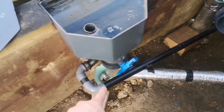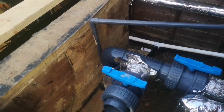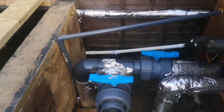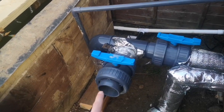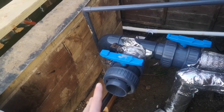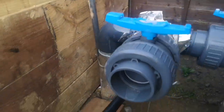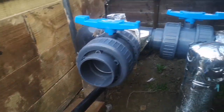There's a three-inch line from the skimmer that goes into the drum filter. That's the waste pipe which also joins up with the drum's waste and goes down to the front. This pipe here is the air pipe for my bottom drain, and then there's the four-inch line for the bottom drain — I've got a purge valve on there which works really well. One thing I'd have done differently is put the purge valve lower, as the lower it is below the water level the more pressure you get through it.